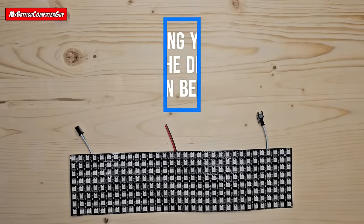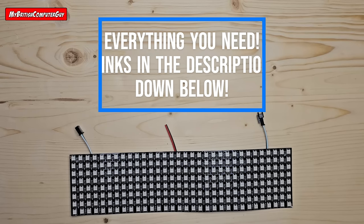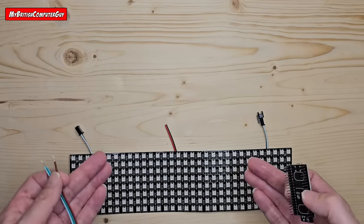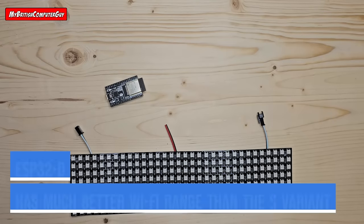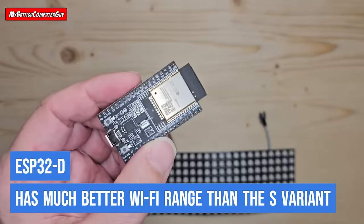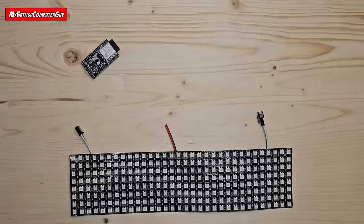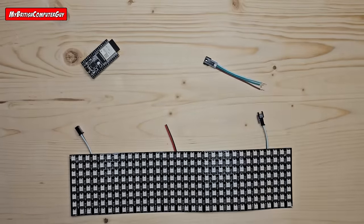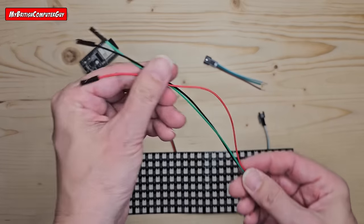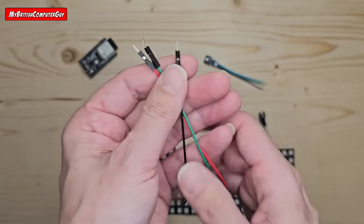What you're going to need for this, I'm going to do a no-solder version of this video for simplicity's sake and for quickness, because I've got three different matrices that I want to plug in and show you. First of all, we need the ESP32, and this is an ESP32D, and you notice the D because it has the overhanging Wi-Fi antenna. We need one of the adapters that came with the matrix. We're going to need three breadboard jumpers, and these are just 20 gauge or 22 gauge breadboard jumpers. I will leave a link to some down in the description below.